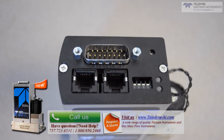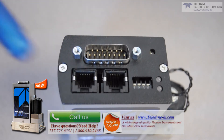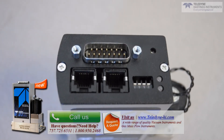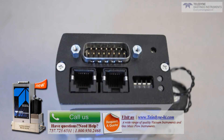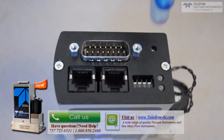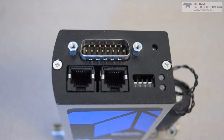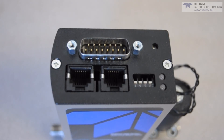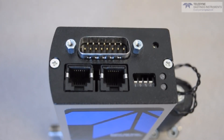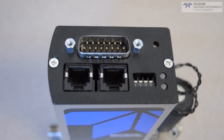On the top of the instrument, two digital connectors are available. With the flip of a switch, the user can have either RS-232 or RS-485 digital communications. The digital setup is easy to control by setting the toggle switches — you can select RS-232 or RS-485, the baud rate, and the termination. You can also control the command mode of the flow instrument, meaning you can select whether the flow command signal is determined by a digital command or by the analog input.